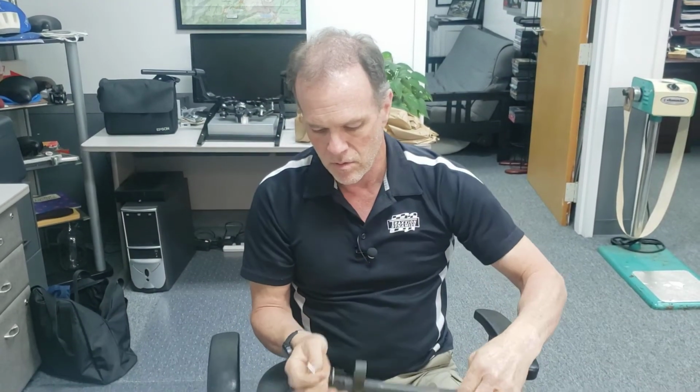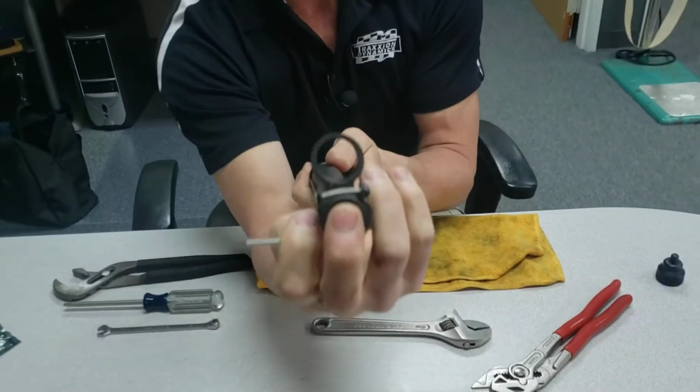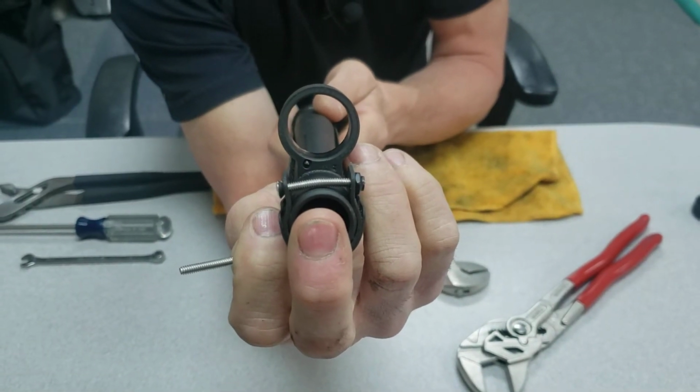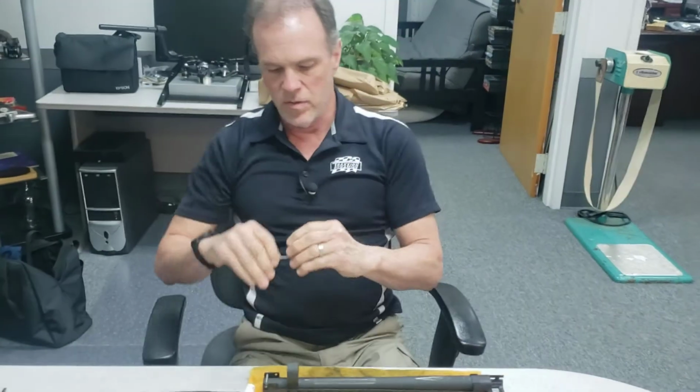But what you're going to have to do is, don't be afraid to look down the barrel, but here, see that bend I've put in that screw there? Okay, so that screw you're going to have that bend too. So don't try and bend it one time into a hat. Take several gentle bends, 2 or 3 across, and create an arc.